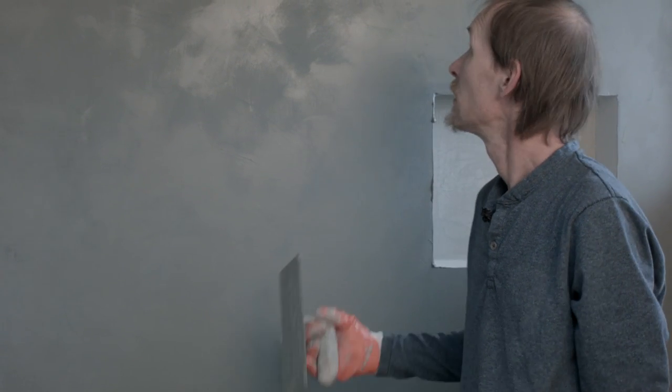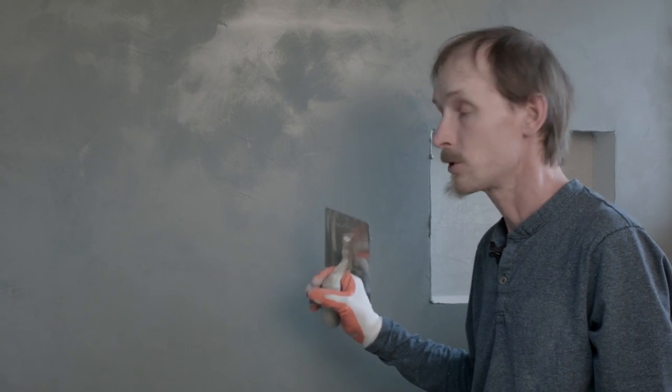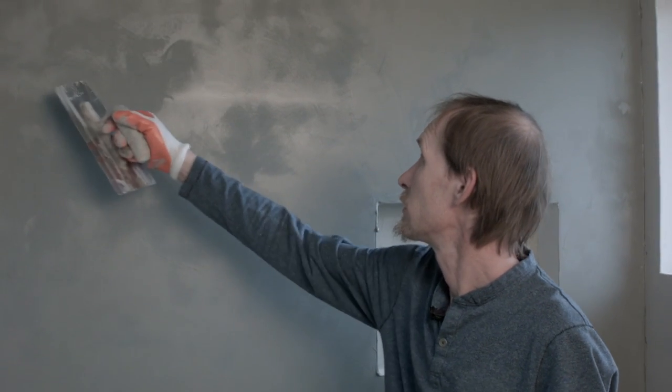That's the end of our second coat of finish. Next we've got to trowel it until it dries out — probably two or three more times all the way across. You've got to wait until it's dried to a certain point before you trowel on it. If you trowel too soon it's going to pull the mud back off the wall. If you trowel too late you won't be able to close it — getting rid of the rough spots is what we call closing. Some areas dry faster than others, so you want to hit the drier spots first and then work around into the wet spots later.